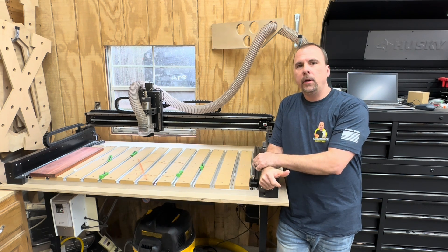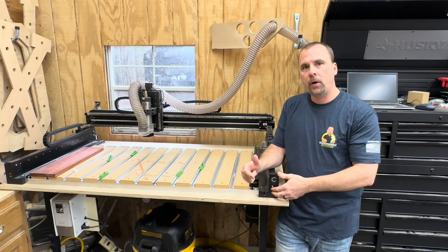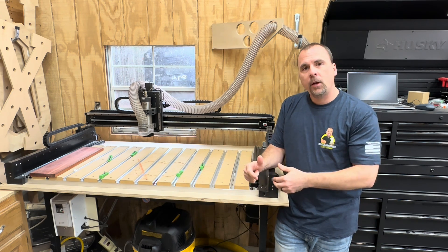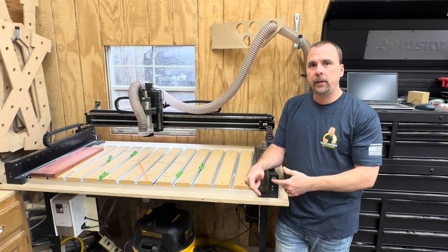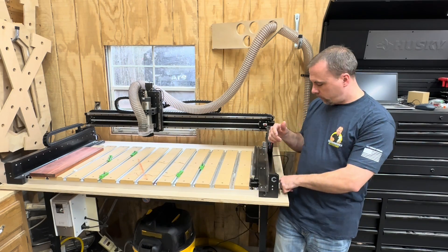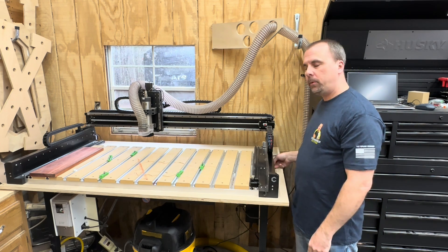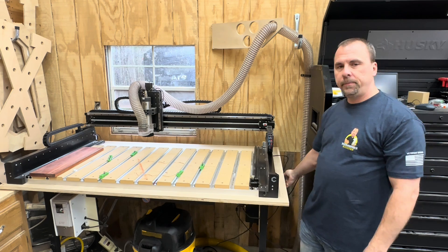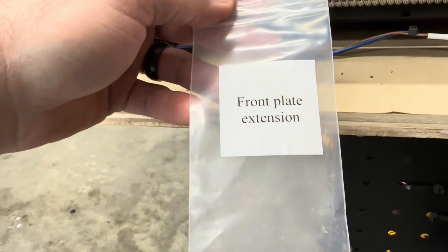When I first got my machine back in December I had a couple of issues with it. It was not running right. This plate on the front was broke and it was getting no power to it. I've seen that issue a lot on the Facebook forum. So if you have this machine and your light is not lighting up where the C is, then you have a problem with this plate or you don't have this wire that plugs in here connected right. This wire is labeled kind of funny when you get the machine — nine times out of ten it's going to be this wire, and it's labeled in a pack by itself. I want to say it's called a front end extension plate wire or something like that, so if you have that issue that's more than likely what's going on.